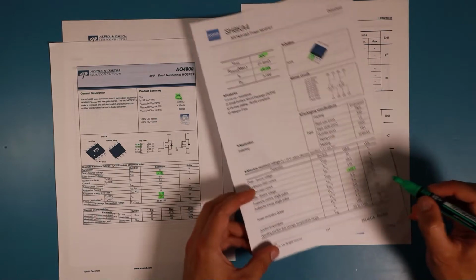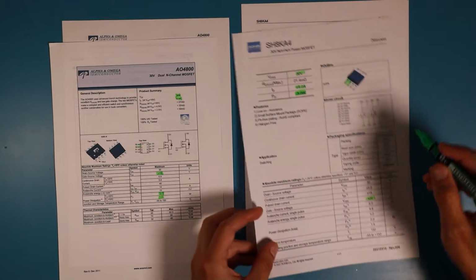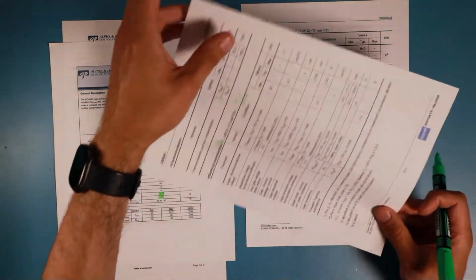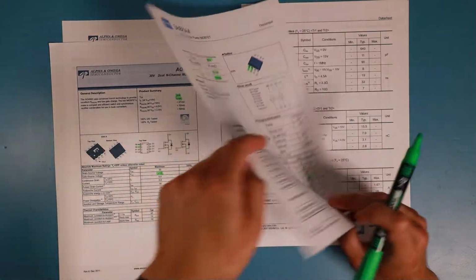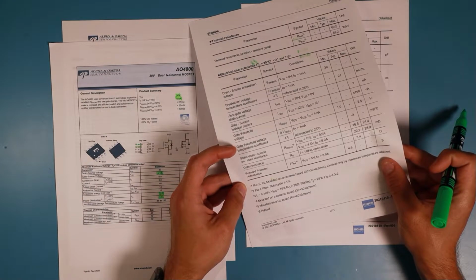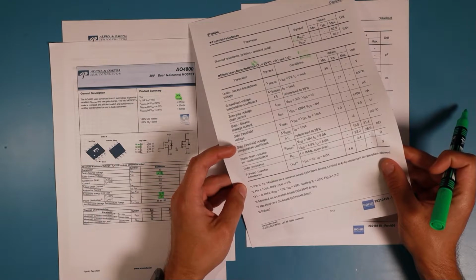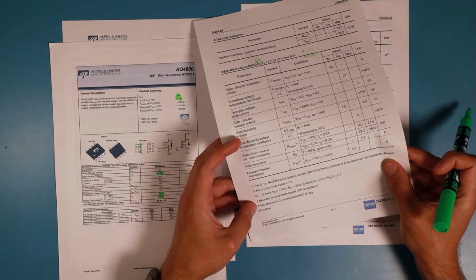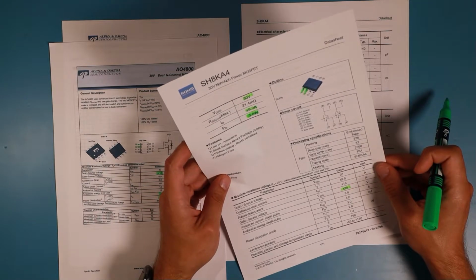In fact, on the top of the datasheet, it mentions 3 watts, but that's only valid to about, where is it? So when we look here, there is a 1, a 4, and a 5. So 1 is on a ceramic board, so special circumstances we don't have here. We have a normal PCB. Okay, mounted ceramic board, mounted to copper board, but okay,